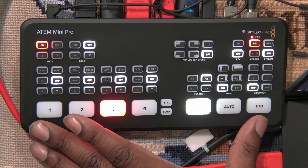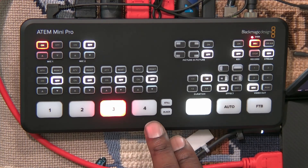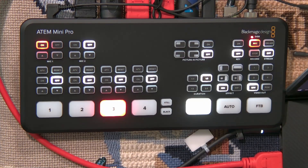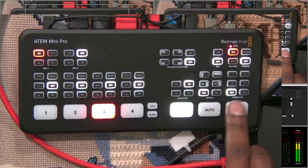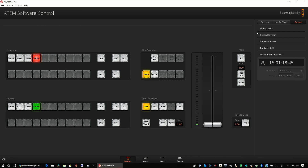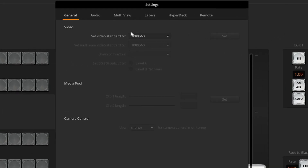One of the major benefits of the Mini Pro as opposed to the Mini is the addition of multi-view, which you'll be able to see — I'll just switch over to the multi-view look, and that is a wonderful feature. Do I wish I had more inputs? Sure. Do I wish I had more outputs? Definitely. With just the one HDMI out, you can either do program or multi-view — you can't do both, and splitters aren't going to help you. But having the ability to go back and forth between multi-view and program is just a simple touch of a button. I'm learning as I go. Our video out is 1080p 60, and as I mentioned, only one device here is set to 1080p 60, and yet we can see it just fine.